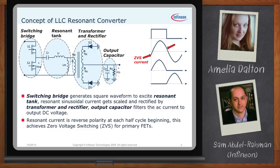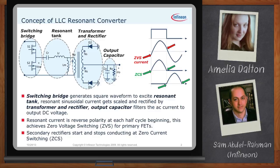That primary sinusoidal current gets transferred and scaled to a secondary side rectifier, then filtered by the output capacitors — a basic DC-to-DC conversion in a resonant fashion. What's special about the LLC resonant converter is the current always starts with a reverse polarity in the primary switches or MOSFETs, and that's what creates the zero voltage switching. Similarly, on the secondary side rectifiers, each diode has a half-wave sinusoidal waveform that starts and ends at zero. The main benefit is soft switching on both the primary and secondary sides.